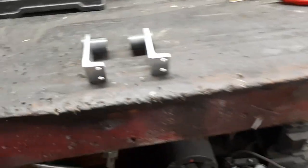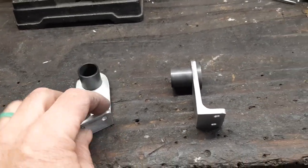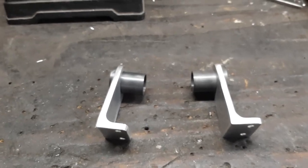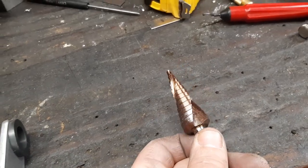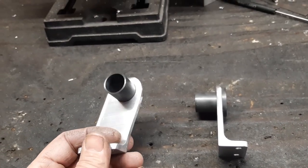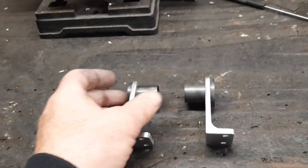Made a little progress on the airplane this morning. Still waiting on the rest of the parts for the control stick, but I did get to finish out the hinges that hold the control stick in there. They're pretty much done — got the bushings in. The step drill I picked up from Harbor Freight that goes up to seven-eighths worked perfect. Got the holes real close for the bushing, then I just used a flap wheel to enlarge them just enough that they slide in there — nice tight fit.